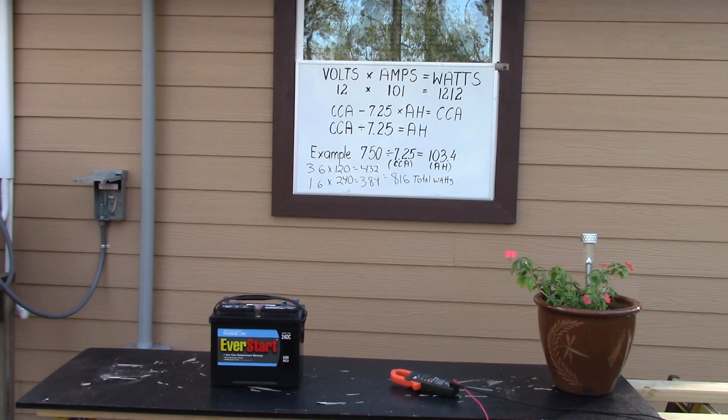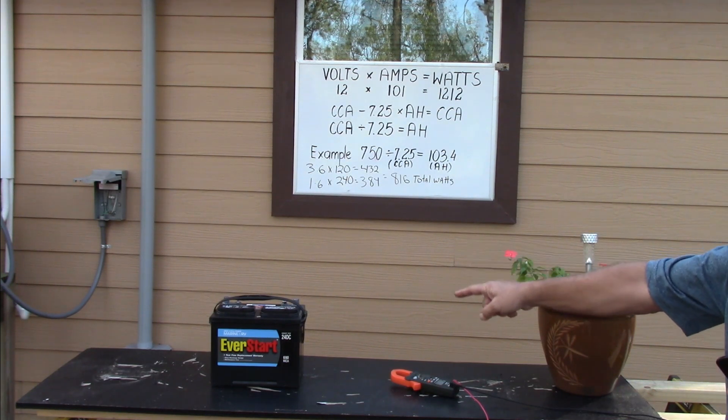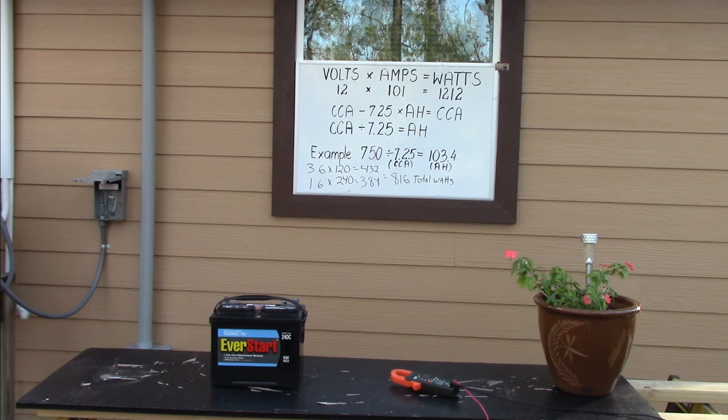That compensates for startup and gives me a little extra. If you're not an electrician, doing it the other way is very simple — just take the wattage listed on your devices. Look at the data plate from the manufacturer for your refrigerator, TV, figure out the wattage on your light bulbs, and combine the total wattage. That will be based on one hour. In my case I have 816 watts per hour, and I'll figure somewhere around 12 hours. So I would take this 1200-watt battery and multiply the number of batteries by the number of hours I want to run.